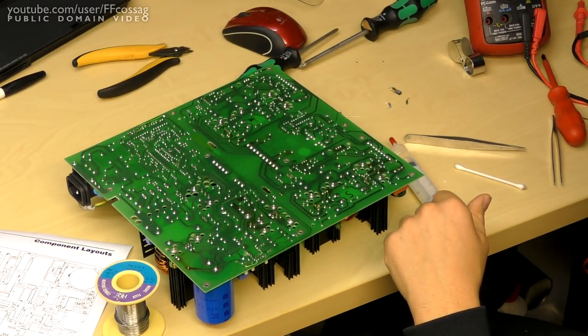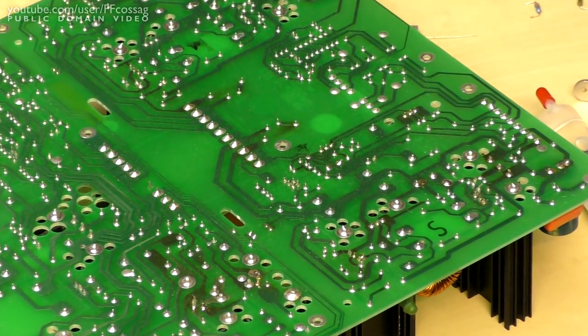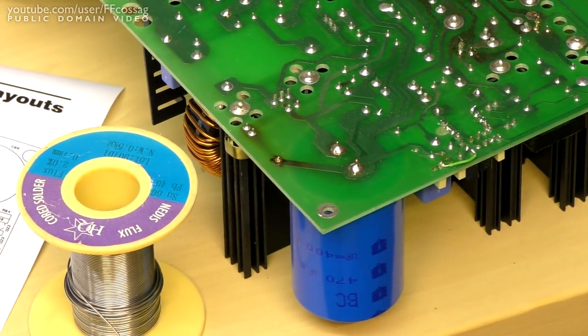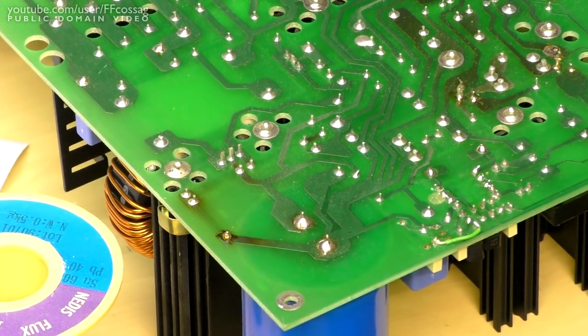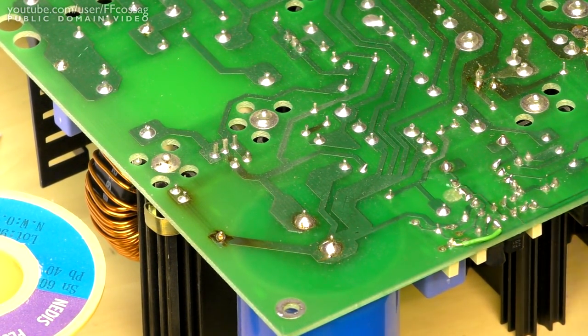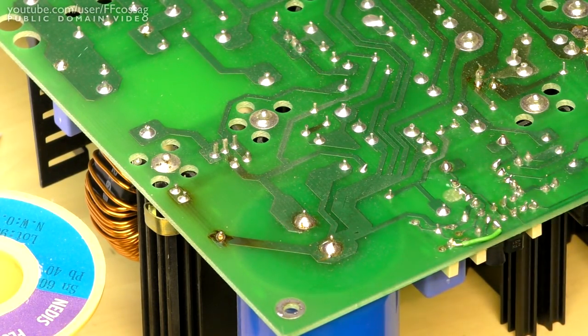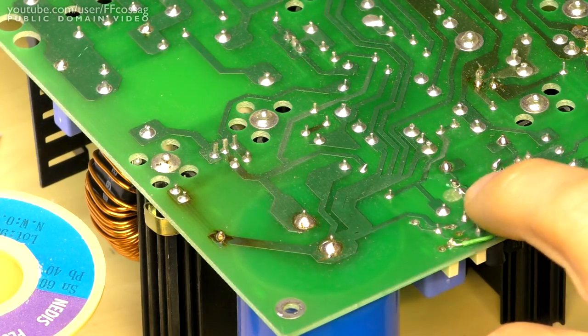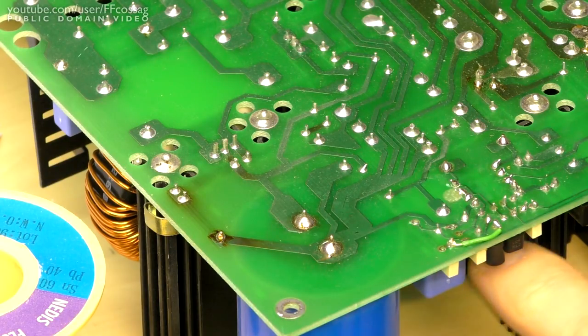I've taken the liberty of actually removing the little test pad which seemed to have caused the entire problem to begin with. It's just entirely removed now. I heated the pad and scratched it off with a knife just to prevent any further failures, but digging for a new transistor isn't going to help us much, because I'm going to have to throw in an order of parts for this thing, because there's just so much blowing.